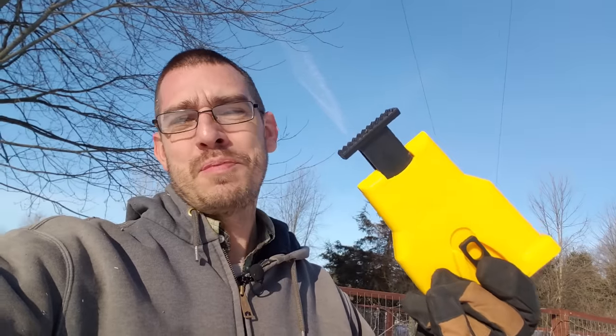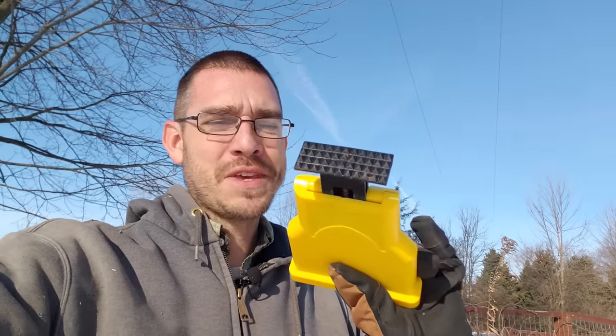The time of the cut was pretty much identical — within a second of each other from the old cut to the new cut. It didn't make a huge difference, but the shavings did prove the chain was a little sharper. Will I throw this away or keep it around? It's kind of a cheesy little tool. I don't think it really addresses the proper technique of sharpening a chain — it only files the top side of the teeth, and used continually, it'll just wreck the chain since it won't get into the gully of the teeth and doesn't address the rakers or depth gauges properly. It might work in a pinch to put a quick edge on the top if you're in a hurry, but overall I don't think it's something I'll use regularly.